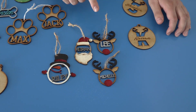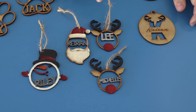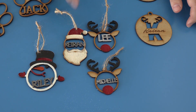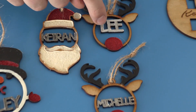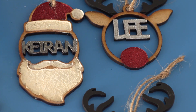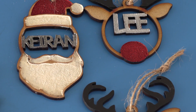This group over here — what I did was laser cut, then in certain areas I engraved deeper just to make sure I can get a nice place to paint. As you can see, the depth here is a lot deeper within the letters — it's just so that it's easier to paint it out, and it also creates a nice depth perception when you're looking at it. It looks quite nice and 3D.